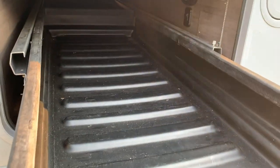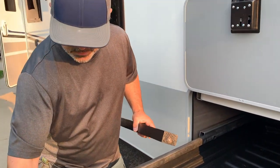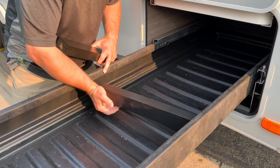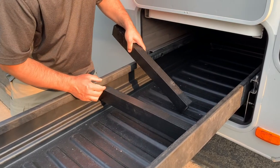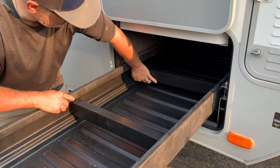The tray needs to be reinforced. So I took a sturdy 2x3 piece of wood and cut two pieces, each 21 and a half inches long. This is long enough to create some tension and spread out the tray — just the perfect length to fit nice and tight and snug, which is exactly what you want.